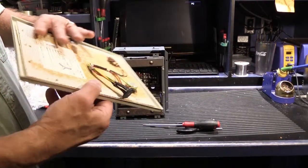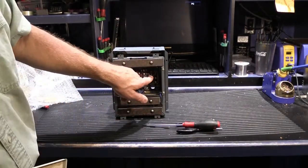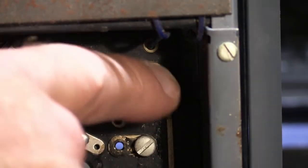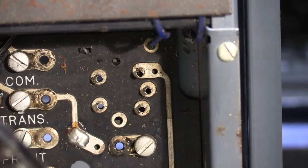And when you install the cover, there's this multi-pinned socket on the back of it, and this plugs into the pins in here. So here are our pins. This is where the volume adjustment would normally be on a long tube chime. And all you do is you take your socket assembly and align it correctly. It's going to be impossible to show you this because it's way too short. This socket plugs into those pins, and that's what connects the tone switch and the volume control to the chime.